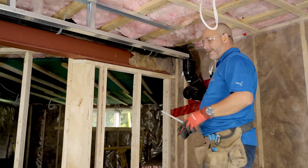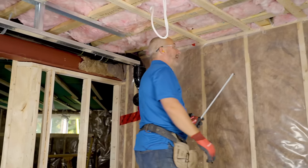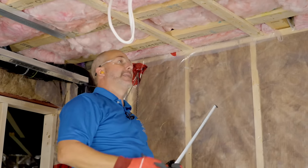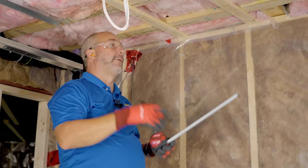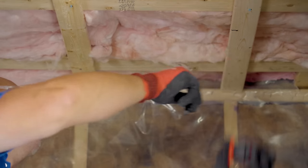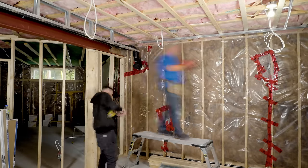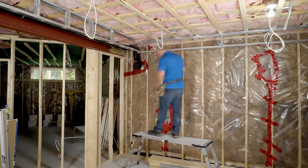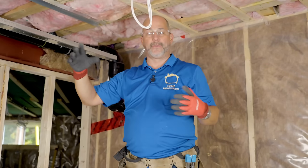Because I wanted 24 inches off the backside — remember we're doing a cabinet and a TV wall here — we want to go about 16 inches and I am 16 and a half. Not a problem. Remember we did the video about why it's important to do your strapping? Because now I've got somewhere to attach my wall. I can't put a ladder in between floor joists unless I have strapping. I already created a new ceiling height by adding the strapping, which makes this incredibly fast.